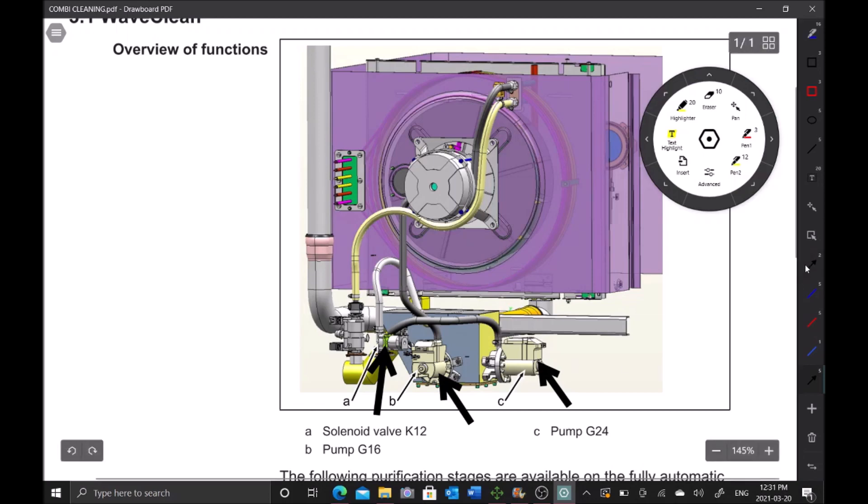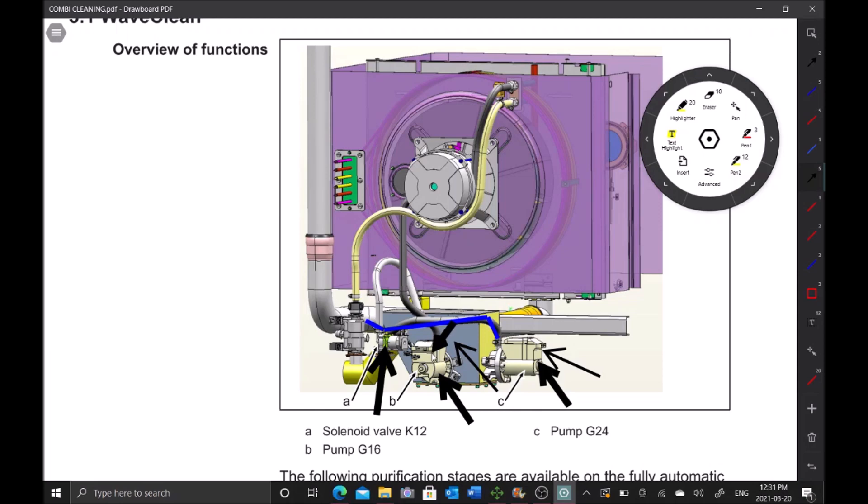This solenoid is going to fill up the quenching box. Then this pump is going to pump all the water out — we pump water out of the box down into the drain. We want clean water in that box. This G16 pump right here is going to be circulating water throughout the cavity, and we do not want dirty water in there. Several times throughout the cleaning cycle process we're going to be dumping water out of the quenching box so we have fresh water.